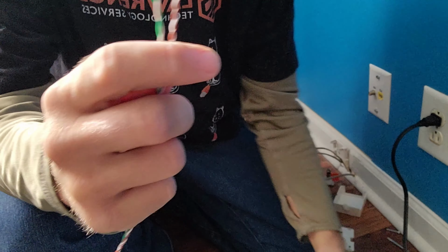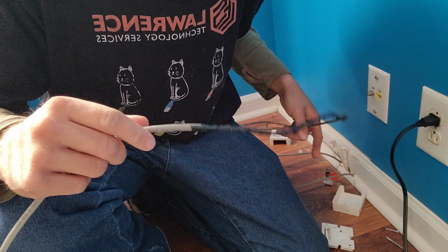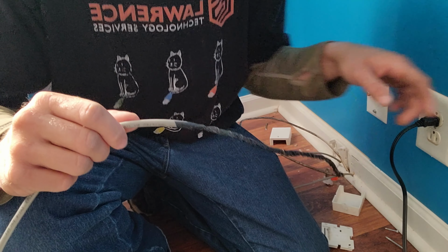and then do the same thing, but before you do it, take your Cat 5 that you're using as a pull string, run it through the loop, and then take yours, make it go back to the end, pinch it with your fingers, and then just twist this part. Alright, this is the electrical tape on either end. I got Cat 6 over here, old Cat 5e over here, and then you just shove it down the hole. I normally try to get the electrical tape shoved down the hole, and then I'll show you outside, and hopefully it'll pull straight out to me.